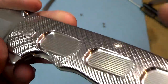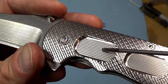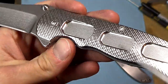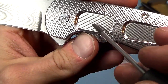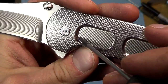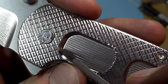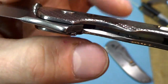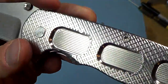The third toolpath I did is a trace toolpath that traces this contour, because doing a linear toolpath leaves it with little divots — dent, dent, dent. When I do the parallel, it goes back, turns around, comes this way, and it leaves a little divot there, there, there — it doesn't look so clean. So coming in with a ⅛-inch ball mill and just tracing in there cleaned it up and made it look really nice and shiny, because it's tapered down. The trace is kind of a 3D path that goes down and then back up. It worked out really good.